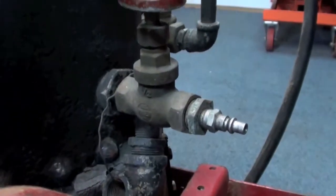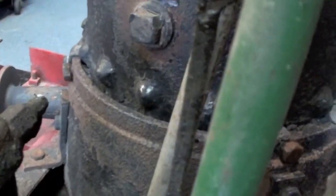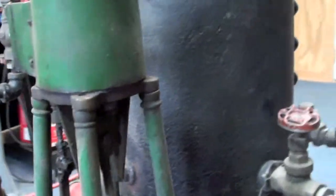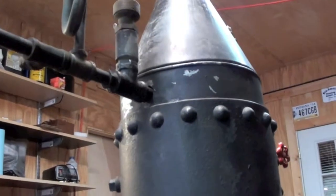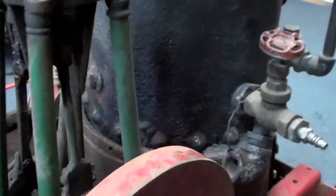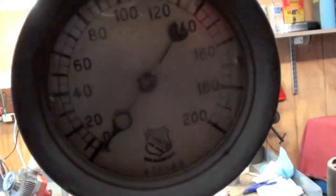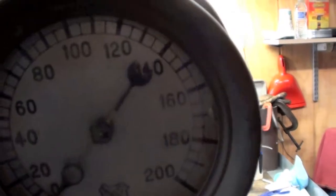So that's about it. Blow down valve. It appeared to be a little rough at the bottom, but I think it's just crud and junk on there. There's some surface rust, but we'll take a look and see what has to be done to it. It's promising because it holds air. Being as small as it is, I don't think it's going to be all that dangerous to operate. I don't expect to run it much over 60 pounds. He told me the pop-off was set at 80, but it's all to be tested later on.